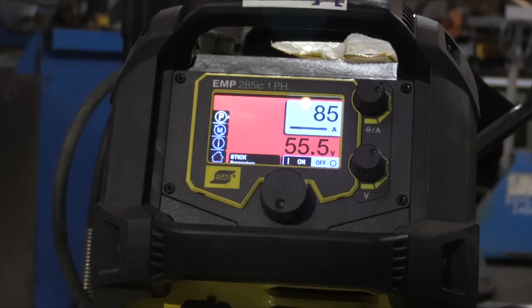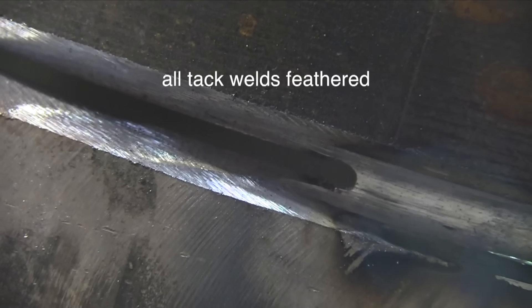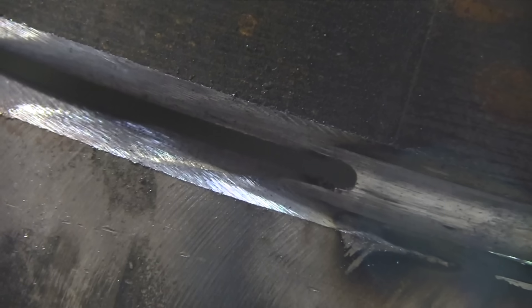The tacks did seem a little cold at 80, so we bumped it up to 85. Now we're about ready to get started. All tack welds are feathered with a grinder first. This is the very bottom tack at 6 o'clock. Getting ready to light up in the middle of the tack, then heat it up and gradually take it on up to the very end that's been feathered. And you'll hear it punch through — you want to really keep that thing jammed in there.